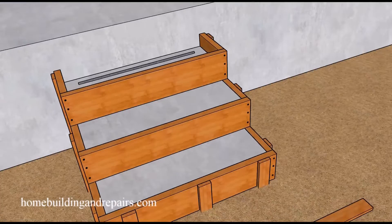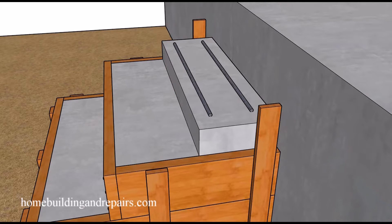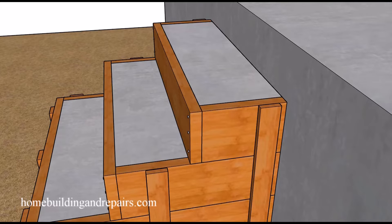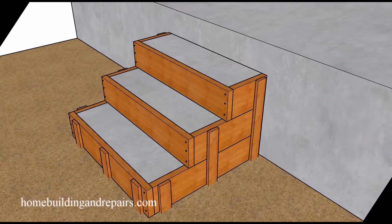For the last step, we can use two pieces of rebar. I'm using number four rebar here, though you could probably use number three rebar if you wanted to. Here's an idea of how we filled it up about halfway and then set the rebar in. Last but not least, we will need to fill up the last section of the concrete stairs.